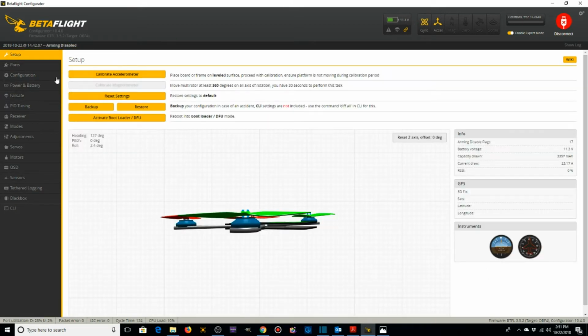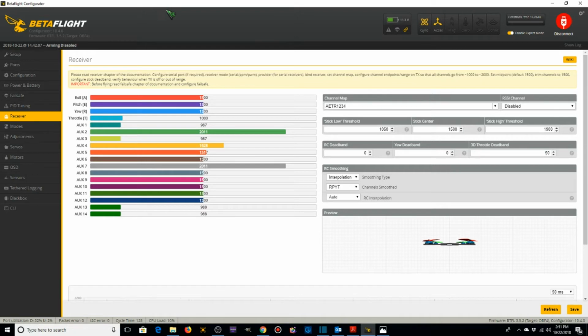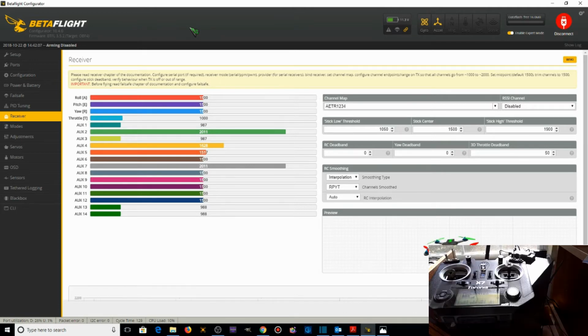Okay, before we get into the PID tuning, I want to go to the Receiver tab first and check to make sure that our channel mapping is correct and that all the channels are working properly with my controller. So we're going to swap this out. Okay, so now we're going to check out the channel mapping and make sure all of our channels are working properly with the transmitter controls.